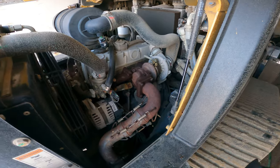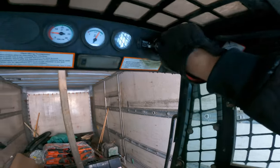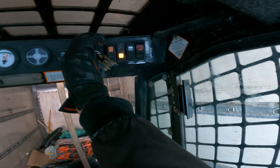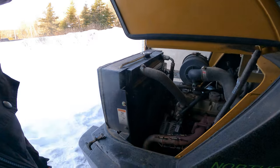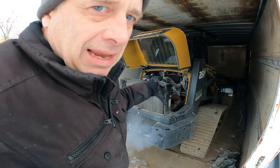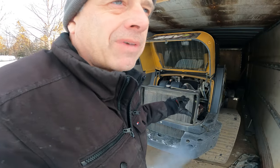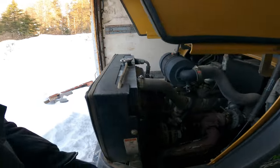I was trying to figure out how many hours we've put on this since April 2020 — we're currently at 1,587 hours, so I've put about 150 hours on the RT60. It's cold out so we'll put the glow plugs on and give her a little throttle. One thing I maintain most on this machine is the fan belt — I change it about as much as I do the oil because these belts wear out.